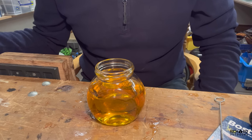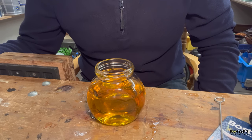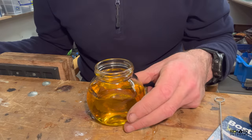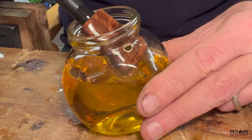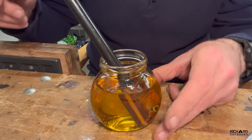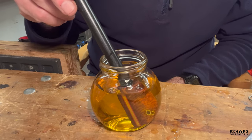Because the wood isn't stabilised — it's prone to getting cracks as it dries out; stabilised wood involves a vacuum process impregnating the grain with resin so it never cracks — the best I can do is a mixture of 70% boiled linseed oil and 30% white spirit. I'm going to pop that in now and let it soak for 24 hours, hopefully impregnating the grain with a bit of protection.